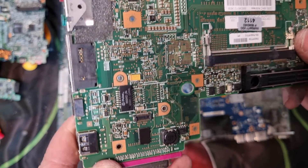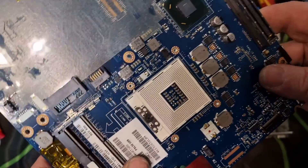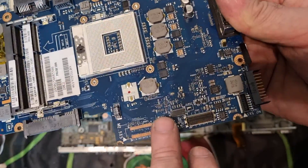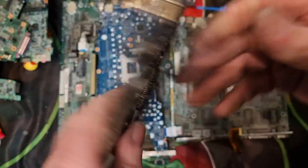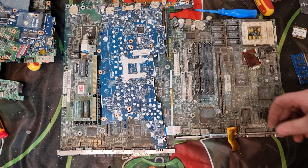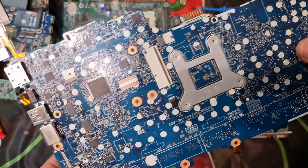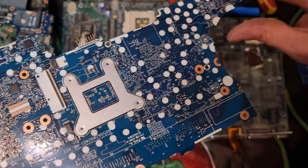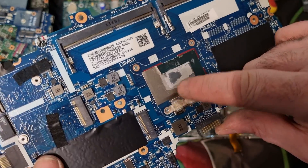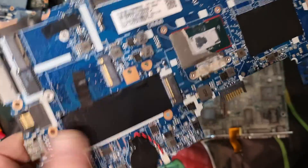Here's another gold corner BGA, other chips, a CPU, and a bridging chip. Where the RAM was connected we have gold flash pins, more gold flash pins, and yellow tantalums. Some smaller MLCCs — not as good as other boards. The back side is pretty slim. Then we have a very poor board — very little on it, a few little chips, no gold corner BGA. This board is from one of the newer laptops — very little on it, an integrated i5 CPU which isn't great, and some pins. That's about it.